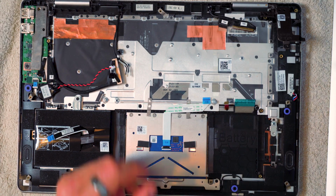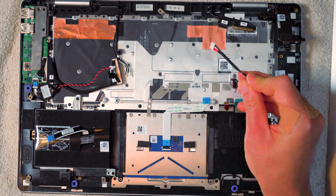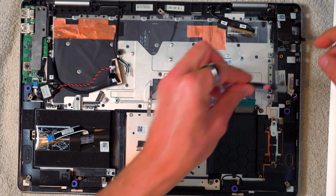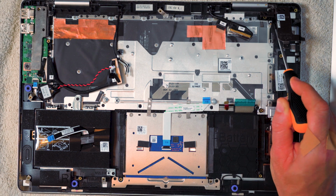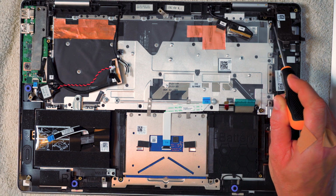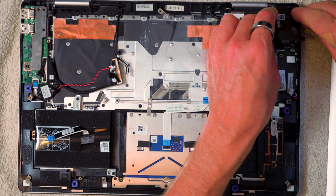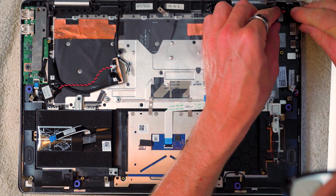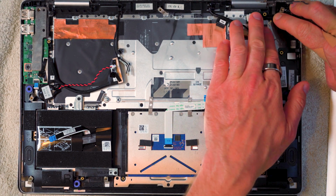Okay, so now I've got a replacement part, the correct part, so it looks like this. You can see that the connector looks quite different to the old one. I'm going to secure this in place. Obviously the screw hole needs to be the size of the screw thread. There's a little plastic sort of lug just sitting out there, and the battery cable wants to go in between that and this bit of plastic here, so it wants to be routed in this channel here. There it goes. There we go, that's a bit easier. Now that that's up, that's a bit easier. Okay, there you go, you can see the plastic channel just there.